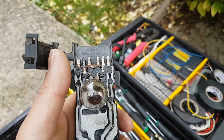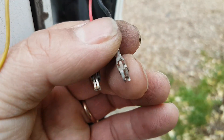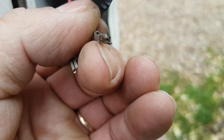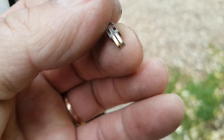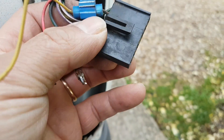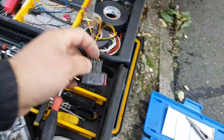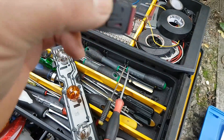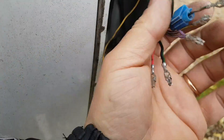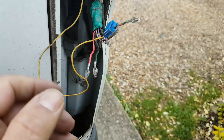I removed the pins from the plug — look at that. They're still fixable, just a little rusty and kind of burned. The other ones are also rusty, so we're going to remove them one by one, give them a good clean, and it should fix our problem. I do have replacement pins in case I need them, but I think we can clean these and salvage them. All cleaned now, so we're going to grease them up and put them back in the plug.